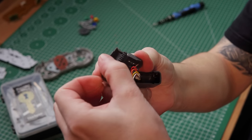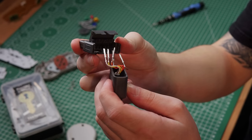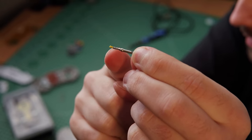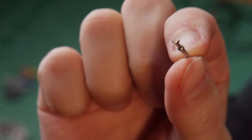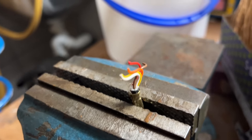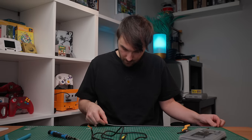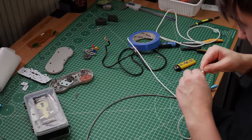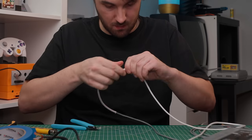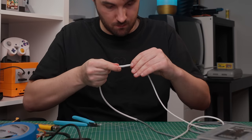Now just open up the back end of the plug and get all the connectors out. These are the connectors that we need — I don't know the specific name to buy them online, so I figured why not just reuse them from the original cable. So I chop them off and carefully open the two little wings on the cable end, then set them aside as I need them later. To get that flattened ring off the cable I use the vise to get it back in a round shape — be careful as it could easily break. For the new cable I measured around 2.3 meters of length from my 5-core roll and cut it. Then comes the sleeving part — there is an awesome tutorial I will link down below. Make sure the paracord is long enough.